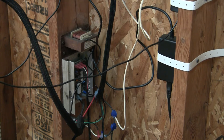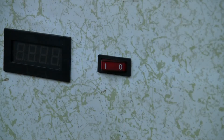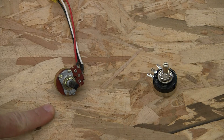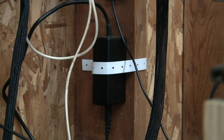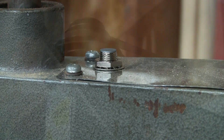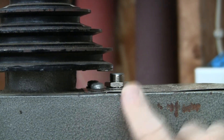Next step was to mount the electronic speed controller to the wall and make a control panel. I used a hideous piece of 1970s Formica — which clashes very nicely with my disc sander table — to mount the system controls between these studs. I found a nice lighted rocker switch in my spare parts collection. This particular treadmill used a 10K ohm potentiometer, but I wanted to get slower speeds so I bought a 20K pot on Amazon. I also bought a digital tachometer on Amazon — it requires 9 to 15 volts DC to operate, so I found an inline 12-volt adapter from my AC adapter collection. I wired it directly into the main switch so everything powers on with the system. The wiring schematic for the tach was clear and easy to follow. I super-glued the magnet to the bottom of the pulley after scuffing both surfaces with sandpaper — it doesn't line up perfectly because the casting is in the way, but it's close enough that it works.